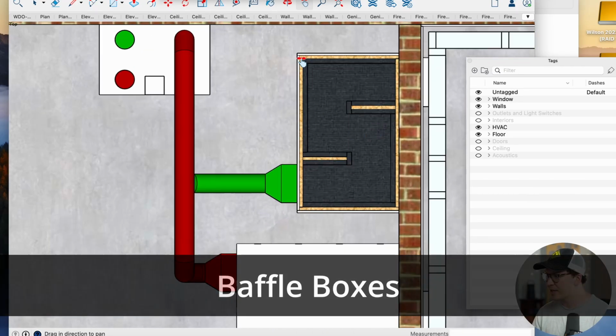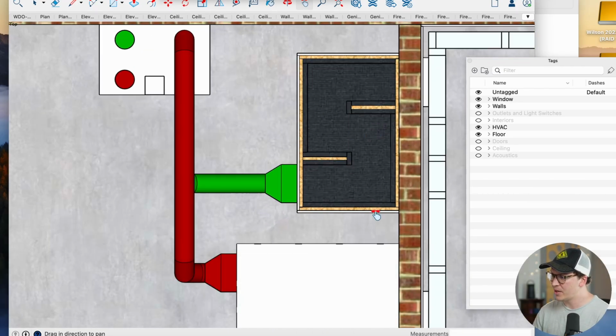So the baffle boxes are mainly made of plywood and then drywall, and then we've got these baffles made of plywood. The black stuff you're seeing here is from a material called duct liner. It's made for HVAC systems, and it's made to absorb sound. So I always use the Second Skin Audio duct liner, and here we'll use it even in Bali. We'll have it shipped out to him because this stuff is really, really good for absorbing sound and also maintaining good airflow through the duct as well, and not causing any mold or bacteria.